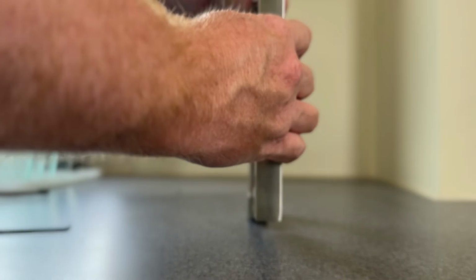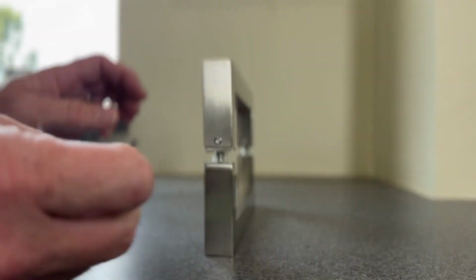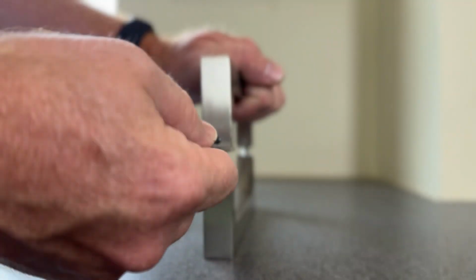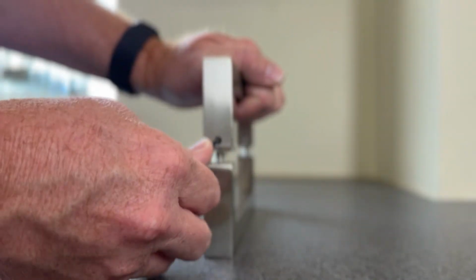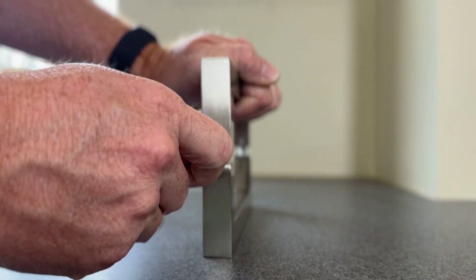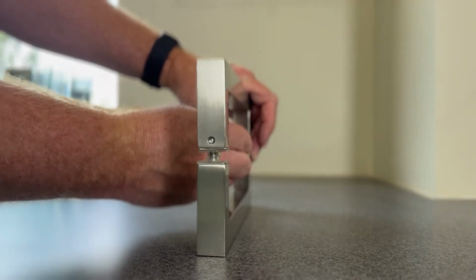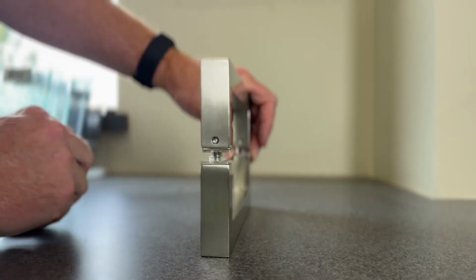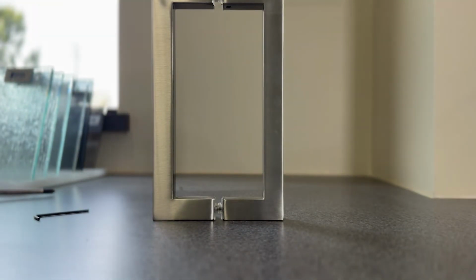Next, you will then slide your handle back on, and you want to tighten those set screws back in place. Once again, being careful not to scratch glass, which might mean taking a little bit more patience and time with it, because to tighten it, maybe you want to use the long end, get a little bit more leverage, but that's going to hit your glass if you had it too close to it. Tighten up the other side. And that should have a nice tight handle.